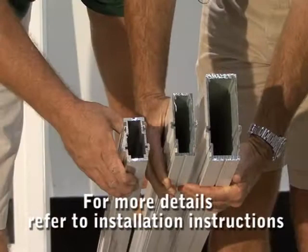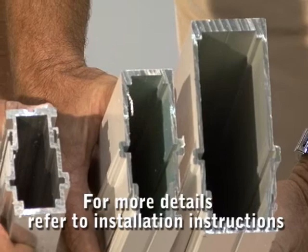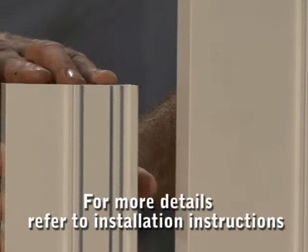If you're going by tip dimensions on the outside of the building, when you use a three or four inch mull bar, it only takes up an eighth of an inch on the outside. On the five and a half inch mull bar, it takes up five eighths of an inch on the outside when using your tip dimensions. You need to know how much space your mull bar is going to take up when measuring inside and outside.